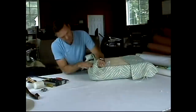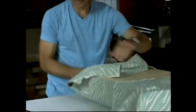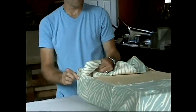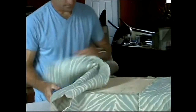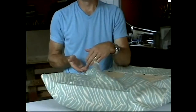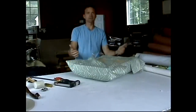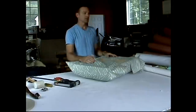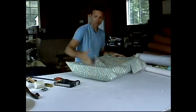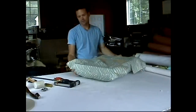I'm coming up right to the edge of the wood there. I want to go around this and then we're going to fold this over and get that corner. We have to go around the short side to the long, because when you look at the long side of the arm — and most people do not look at the short end, they look at the long end — you don't want to see the pleats there. You'll see them on the short end, but most people don't look there. So you want your pleats to lay down on the long end. So you take your short end when reupholstering and go around the turn, and then you lay your long end down over top of the turn. So that's what I'm doing right now.